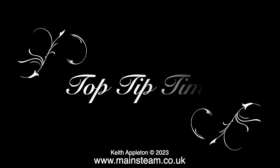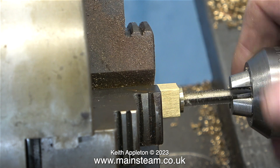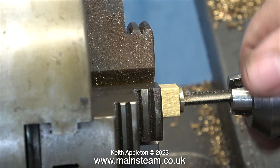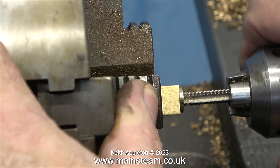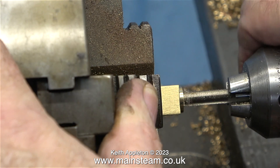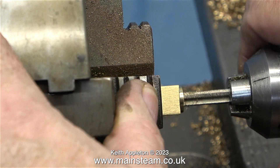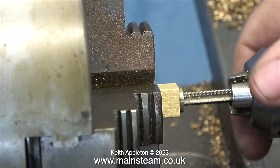So now it's top tip time — a better way of doing the job. Instead of turning the main chuck, I'm turning the tailstock chuck. It's not firmly pressed into the taper so it turns with ease. When using a small lathe like a Myford or a Boxford it's easy enough to turn the chuck, but really this chuck is far too big for a job like this.